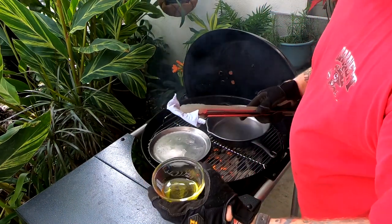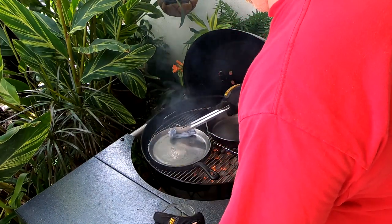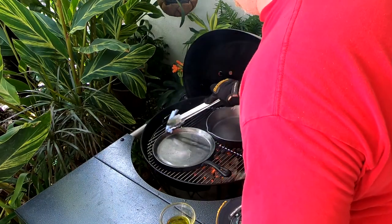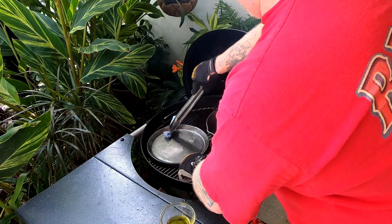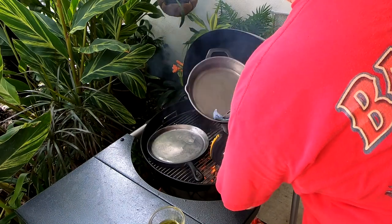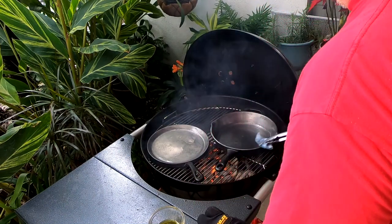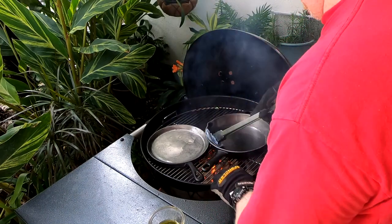I'm using olive oil — you can use a number of different kinds of oils. I'm taking a shop rag and applying it. You're coating all that raw metal, but you don't need a whole lot. I'm going around the edge, getting all those little spots — anywhere I might have done some grinding on the middle or on the sides.